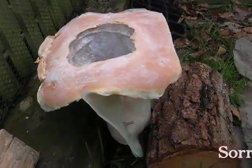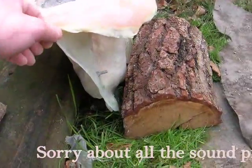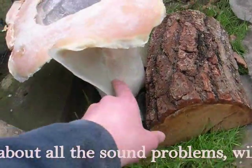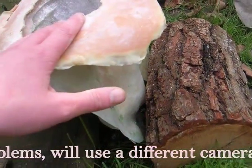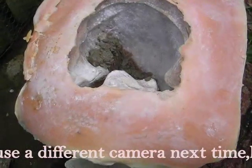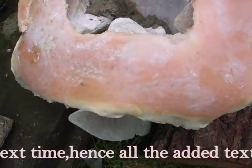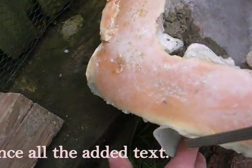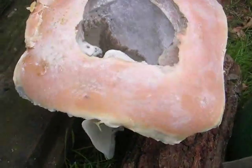Okay, so I have got my fiberglass with the dog mould inside it all bolted up, just supported there. Going to mix up some concrete. So just spooning it in there, and what we need to do as well, once we've got a bit in there, is tap it to let the air bubbles escape and it to reach into the crevices. I should just continue doing that until the top.